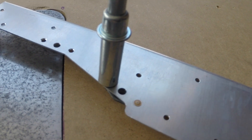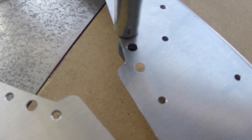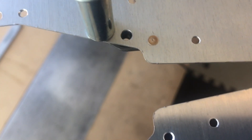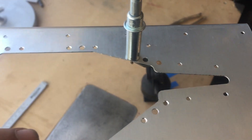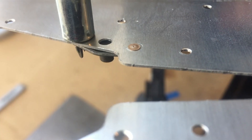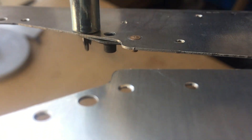That's what she's gonna look like. I would rivet it together for you but I'm still waiting for my number six dimple die. There's that NAS 1097 in there, and there's that rivet from the back side — that'll be a real nice easy set. There are a couple of these nut plates that have to get shaved down because the edge interferes. These are all hints that have been given to me from the Van's Air Force forum — these rivets included — and it's definitely going to be easier to set rivets like that than on dimpled nut plates.